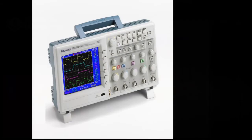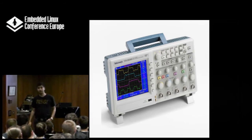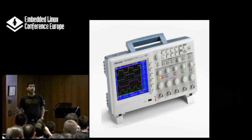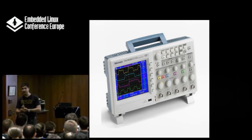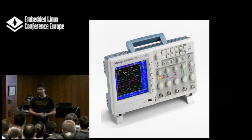The other most important instrument you will ever use is the oscilloscope — mostly because the electronics guys will have it, and mostly because with it you can debug timing: when signals happen and why. The oscilloscopes you will need won't be expensive ones, but I still encourage you to use one of the big three: Tektronix, Agilent, or LeCroy. If you choose one of the Chinese ones, you might be seeing things on the display that are not actually happening, and you're never sure what you're measuring is real.